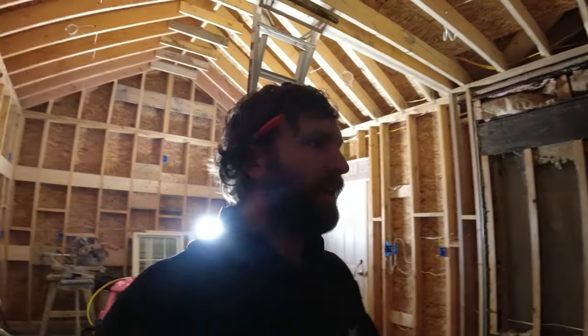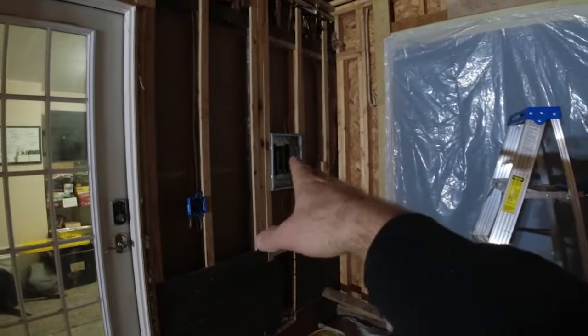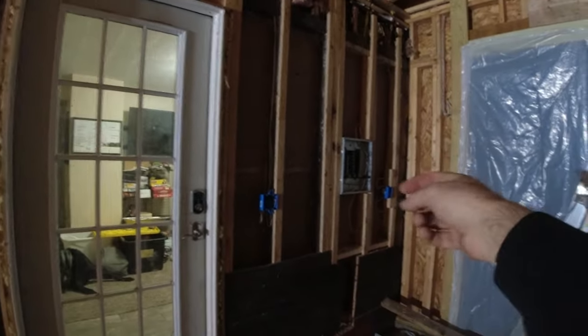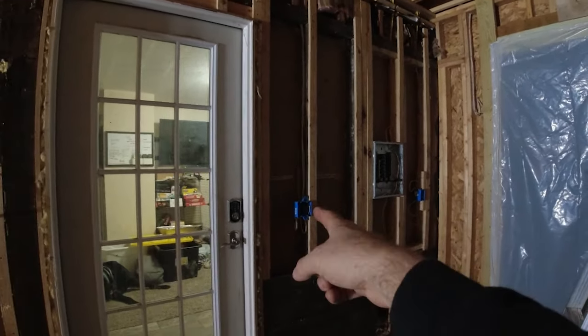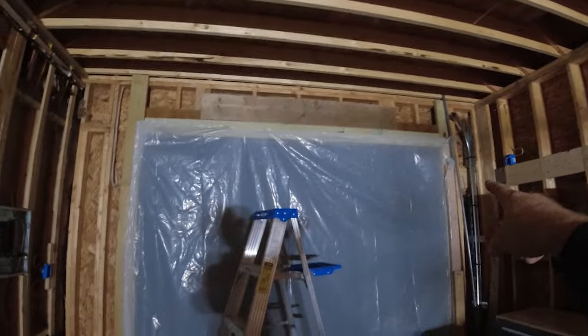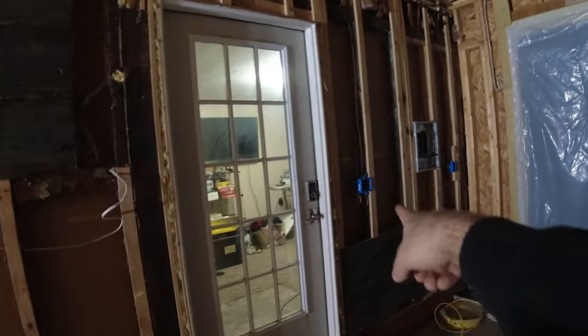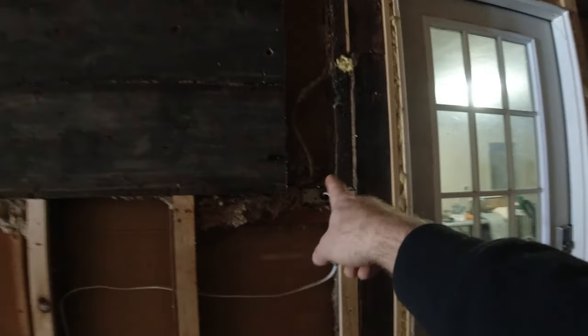The last two things that I need to do wiring wise are, again, I need to run a wire from this panel. All of the lights are going to be on one circuit. So I'm going to run a home run from this panel up into there, come down. Actually, I might even just go through the studs. Yeah, that's what I'm going to do. I'm just going to go through the studs to this light switch box here. Now remember, that switch box controls these two sconce lights outside, as well as that motion sensor camera light up there. Then from there, we're going to run our power up around the door, down inside here to our three-way switch,